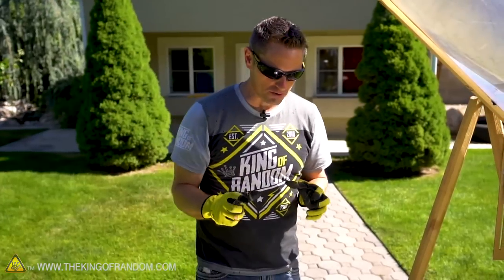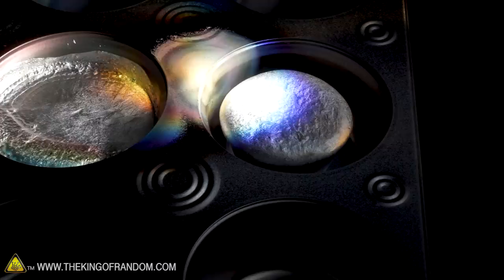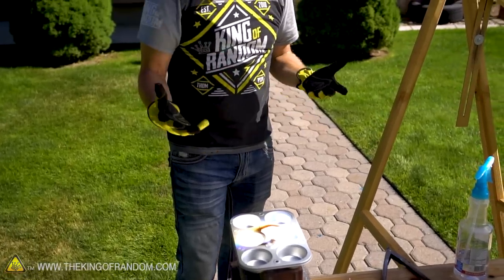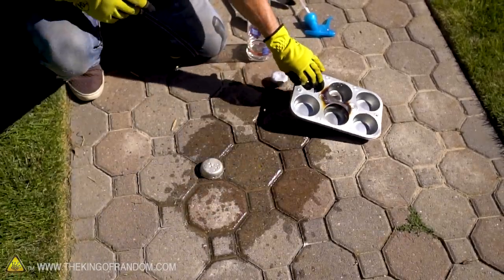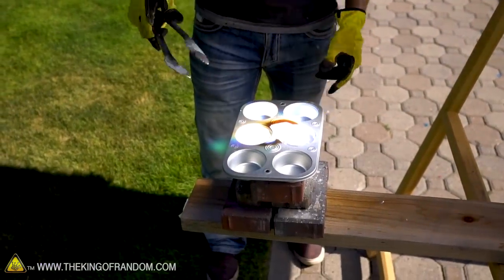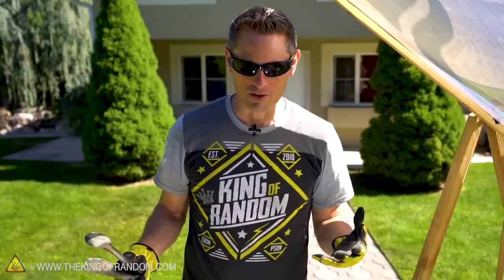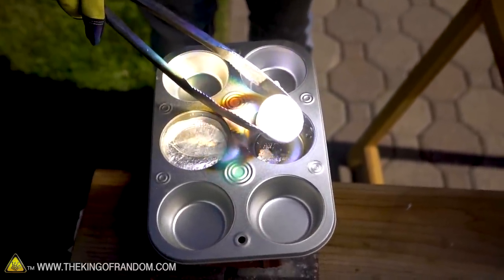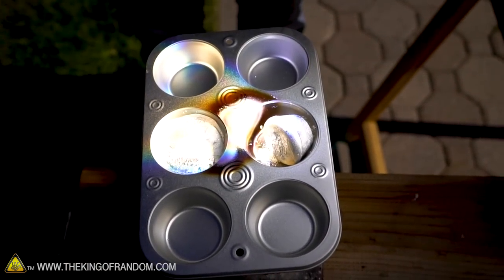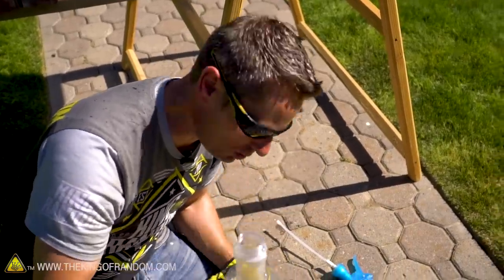Quick update — I'm a little discouraged by these results. I was really hoping sunlight would melt aluminum, but we've sat here for the last 20 minutes concentrating the sunlight on it and nothing has really happened. I'm sure the ingot is extremely hot right now, but it hasn't liquefied at all. The pewter has completely solidified and we can knock it out as a little pewter ingot. As far as the aluminum, I'm almost ready to give up. This does get hot enough to melt those metals — it's just the quantity of mass involved. Even though the focal point hits around 2,000°F, the whole block itself doesn't rise in temperature enough to melt. I'm sure it's ridiculously hot — listen to how it sounds when I pour a little water on it.